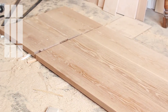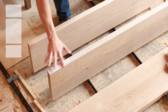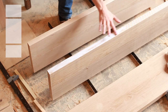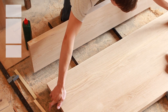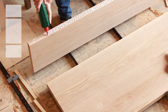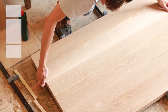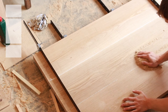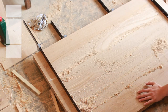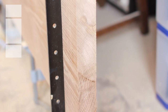Here's how the table looks with all the boards together and the two leaves. For the final glue-up, now that I've cut the boards to length it's important to make sure the ends line up, as I can't cross-cut the entire top with the miter gauge — it's just too wide. After spreading glue on the first edge I put it in place so the glue won't be so slippery when I come to clamp up. I'm using four clamps — two below and two above — to apply even clamping pressure and prevent any bow developing. I spread sawdust over all the joins to clean up the squeeze-out and fill any small voids. Looking at the end grain, I alternated the grain direction so the outer boards run opposite to the middle, which helps reduce warping over time.